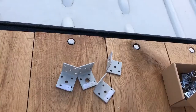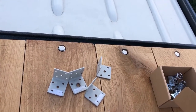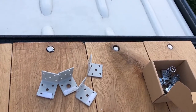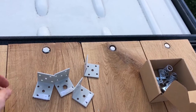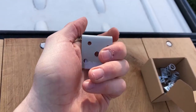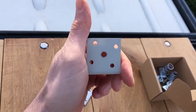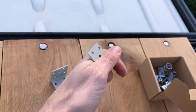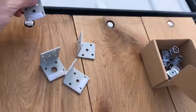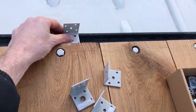Here I am up on my roof again. It's solar panel day - the weather's come out nice so I'm going to get that done while it's good. I've got some fixing brackets and what I've done is drilled them out to 6mm holes. These are going to match all the bolts I've got for the solar panels and also the unistrut fixings. The panel is going to bolt through on here - dead simple, which is what I want.